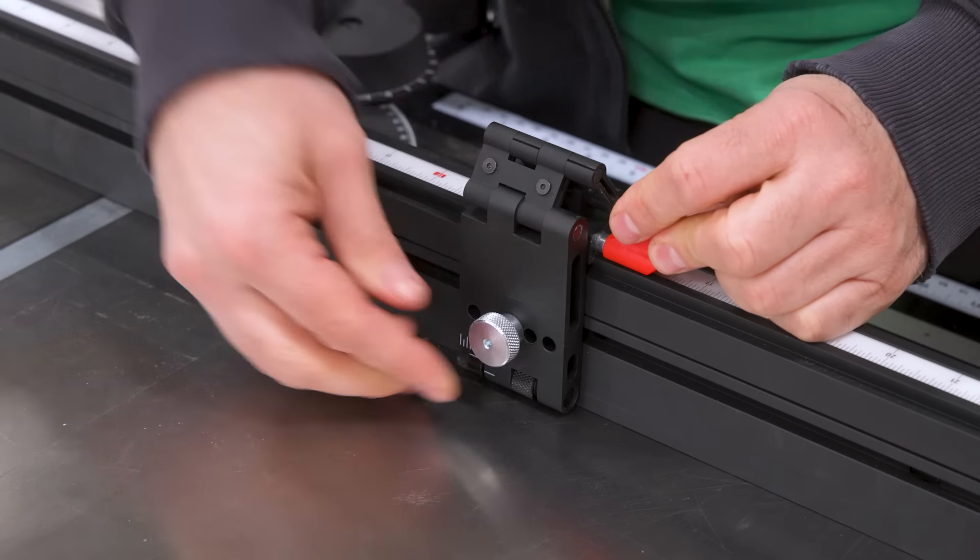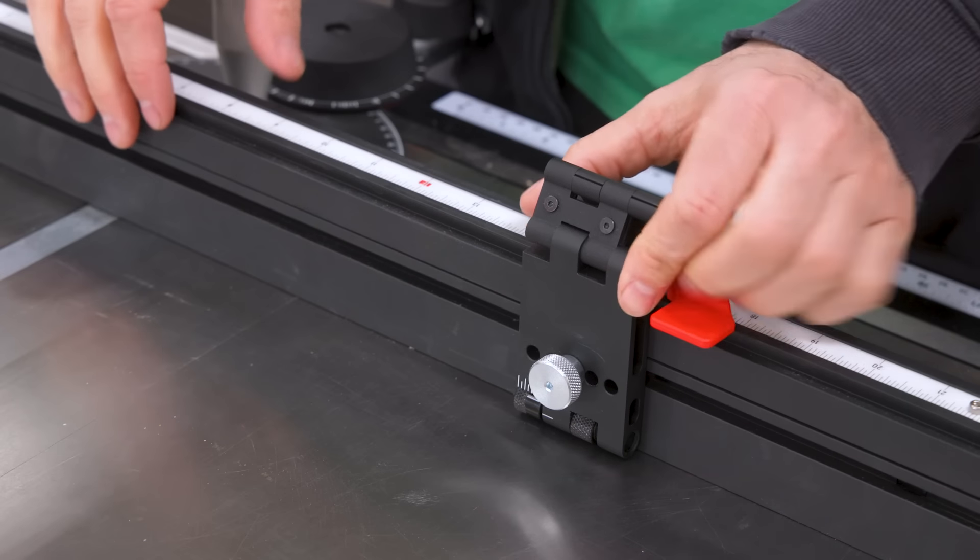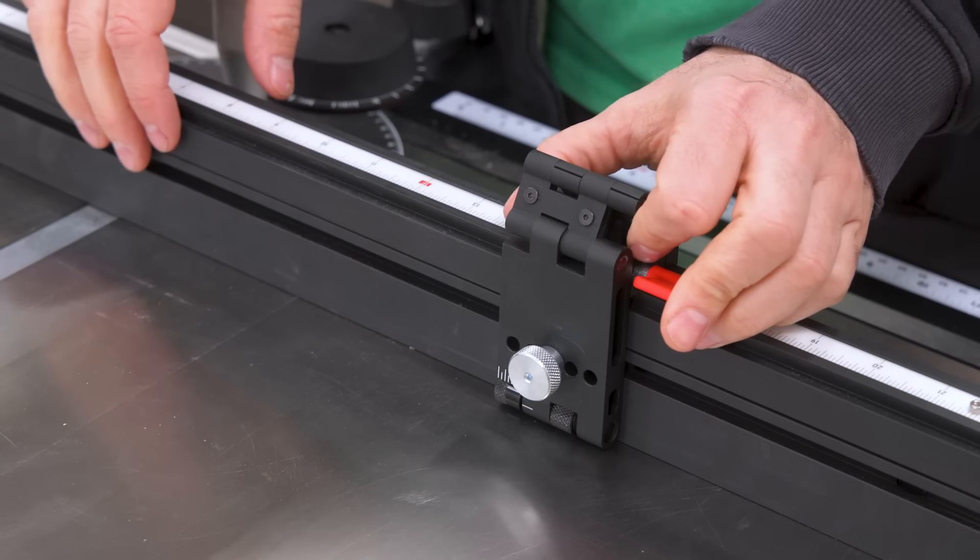That's along the lines of what Katz-Moses does with his, where it's locked down so securely you could smack a hammer into it and it's not going to go anywhere. This knob doesn't really get in the way because we're referencing our work against the fence and hitting that stop. So I think when using this thing, I'm just going to roll like this — keep that screw in there, keep that dovetail connector in there, and this guy's ready to go. It's just two things you tighten down when you have your setting.